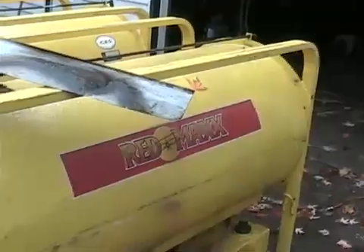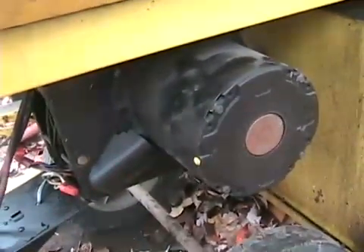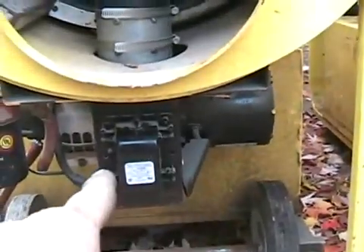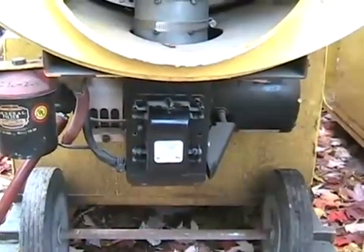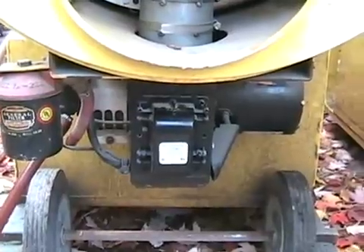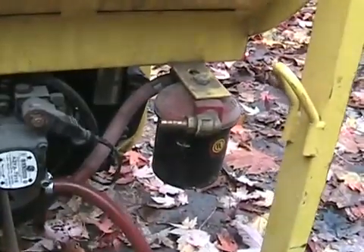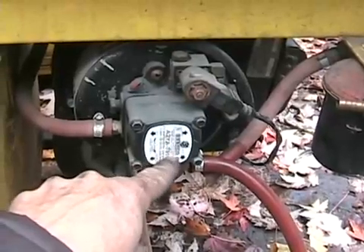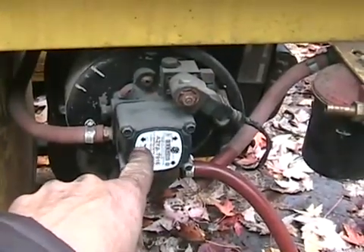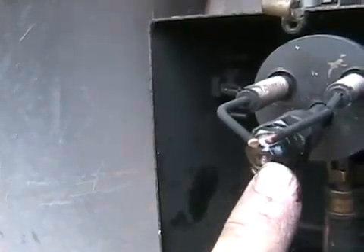The exhaust goes at the top, of course. At the back end of the unit, just like your oil furnace at the bottom, you've got a quarter horsepower electric AC motor. In the center of the unit, you've got that rectangular box — that's your high voltage supply, a transformer. It makes anywhere from 10 to 15,000 volts to ignite the fuel. There's a fuel filter — this one happens to be disconnected — and a little hydraulic pump that's supposed to be connected there. That works just like the power steering pump in your car. It pressurizes the oil fairly high and sends it to the injector. That's the injector — looks something like a car injector.